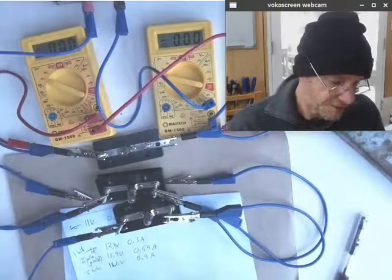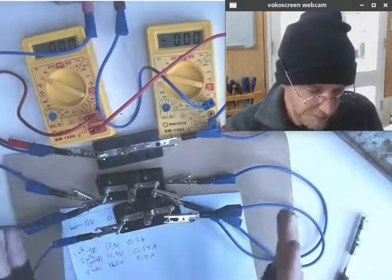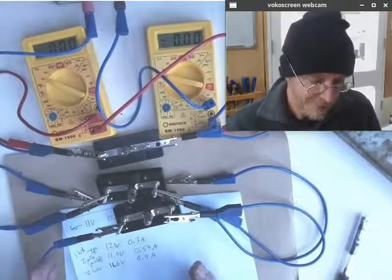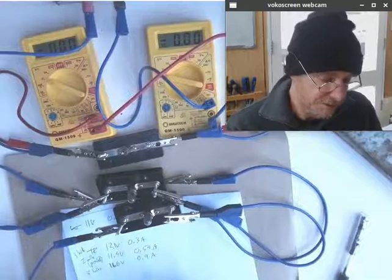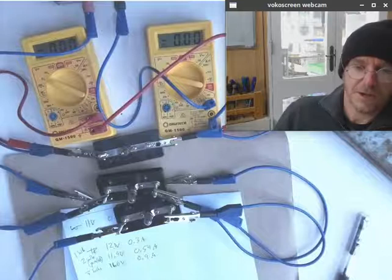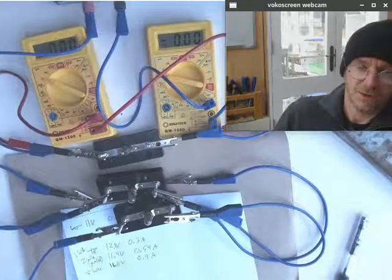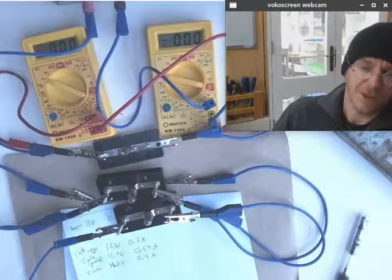On the other hand, when we connected them in series, we saw something completely different. There, we saw the voltage getting divided between the different lamps, and therefore each one completely underperforming compared to what it was supposed to do. And in fact, we saw the total power output and the current in the circuit reduce rather than increase. So the equivalent here is to imagine if you wired a series of heaters in series in your house: you'd see that the overall heating power of those heaters would drop instead of rising. Putting more heaters in series would actually make your heating capacity less. Putting the same heaters in parallel increases your heating capacity each time you attach another heater to another power point.